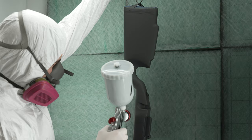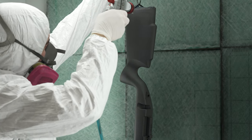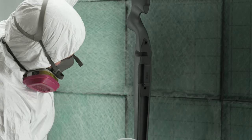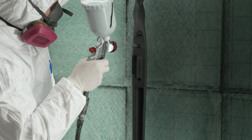While these settings provide the texture and grip designed for this specific coating, many other gun settings can be used to achieve different textures. Be sure to practice on some spare parts before performing the actual application. In general, the less fluid there is in relationship to air, the more you will achieve a velvet or soft-touch finish as opposed to a rough textured finish.